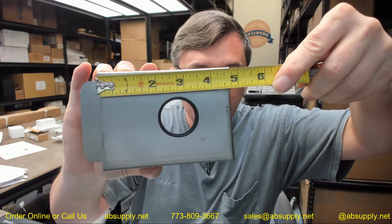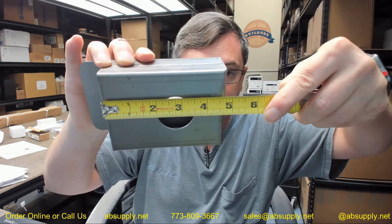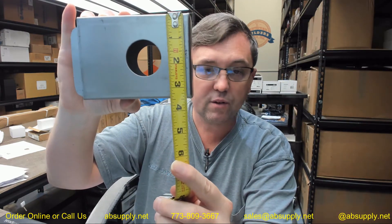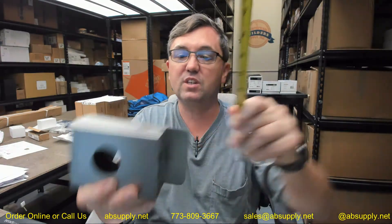There are cloned copy versions of that from import manufacturers that you can use as well. 2.75 backset would take this 1.5 inch hole. Overall height: 3.38 inches, overall width of the box: 4.75 inches, with a thickness of just pushing 1.75 inches. You are going to have this integrated stop that is going to have a total projection of an inch and a quarter.